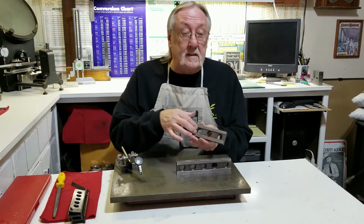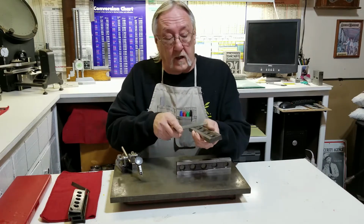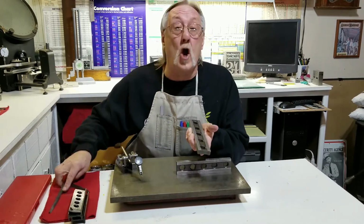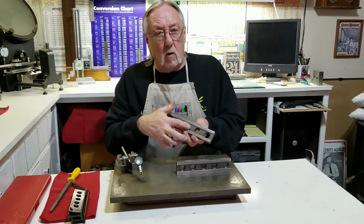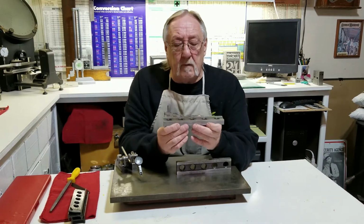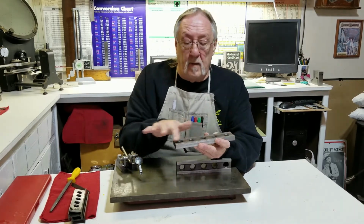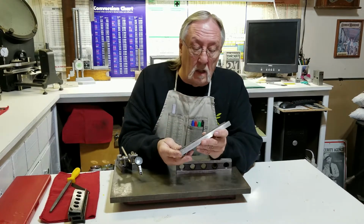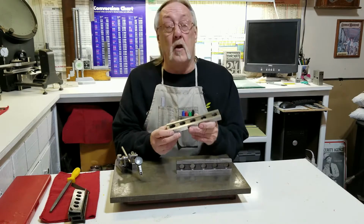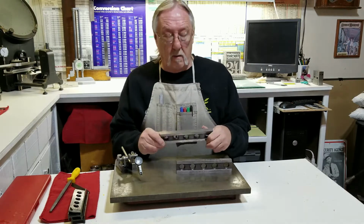And you're not going to do this. Whoever heat treated these things, they are hard. Here, I don't know if you can hear this. Not a scratch on it. They're hard. But it rose up a big burr. I could probably put them in a vise in my manual mill and just go up and back with a piece of solid carbide. It would probably take that off. An old carbide end mill, because that would definitely ruin it. Okay, let's get into that.